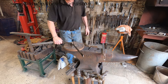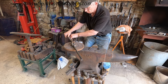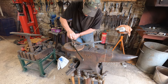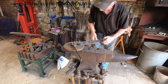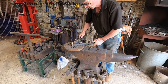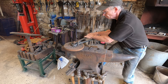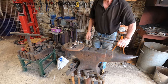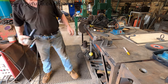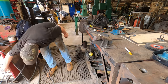Now I'm going to try and bend it around my former that I made. I think I did a video on this. I'll do it cold — it's not that hard, it'll obviously be easier hot, but I can't be bothered to light the fire yet. It's a little bit tough, but we'll get there. Needs a bit of tweaking and tightening up. We'll do that in the vise — put the jig in it and pull it round, which is what I've done. Just clean up the blocks, get the rust off, and fit the handle on.